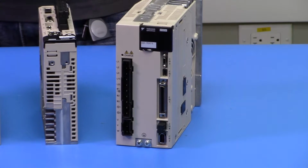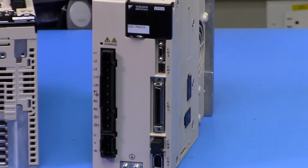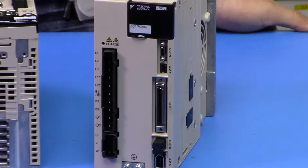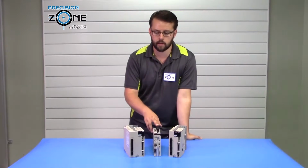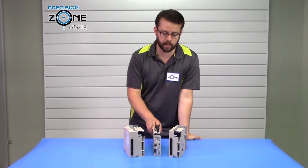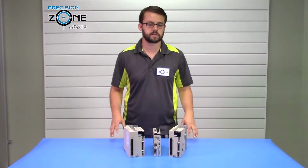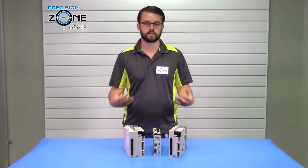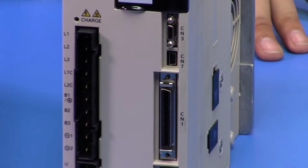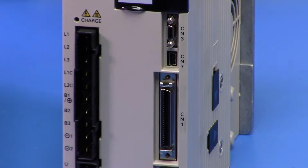For alarms in your 510s or any other alarm in the 500s, that could be your overspeed alarm, and in that case, you want to verify that the connection between the motor and the drive has been set up properly and everything has a solid connection. You want to check your parameters, because that could also be a parameter related alarm. Your 500 alarms also include tuning, so any procedures where you're pairing up the drive with the motor, you want to make sure you're doing that correctly to eliminate any of those causes.